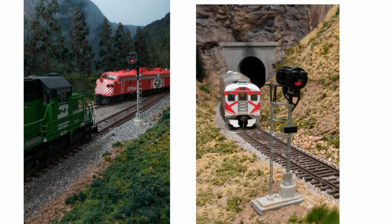And many of them look like this. He supplemented it with also the BLMA signals and the new Atlas signals. One feature that saved us greatly was the fact that the signal LCC boards could be configured to do either common anode or common cathode. Those of you who have worked with trying to build signal systems for layouts have found that you got to watch to make sure that you've got the right type of signal for how you're able to drive it.